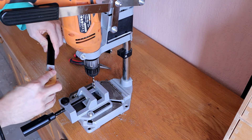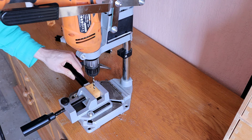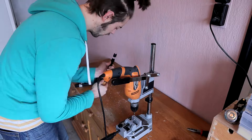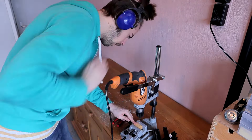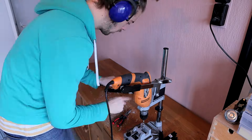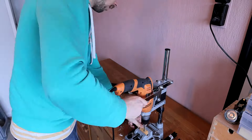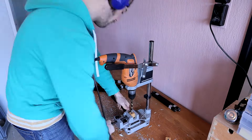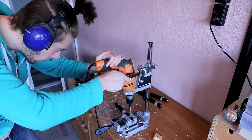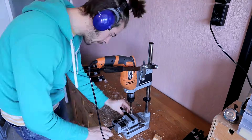To make the holes I used a 3D printed jig, which I will link in the description. Although it wasn't perfect — last time I made a jig out of metal which lasted much longer — and as we're on a budget I don't even have a real drill press, which also made it much harder to make precise holes. For the most part this was fine, but the cylinder heads need a countersink which surprisingly gave me the most trouble, as the 10mm drill just really wants to dance around in the groove of the extrusion.